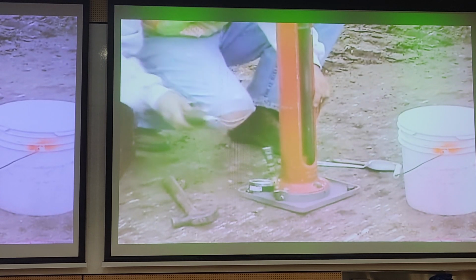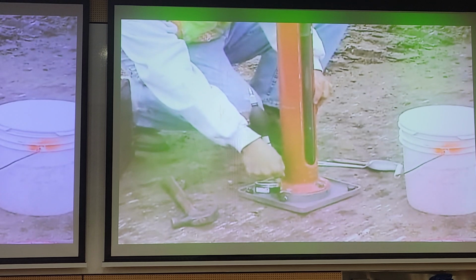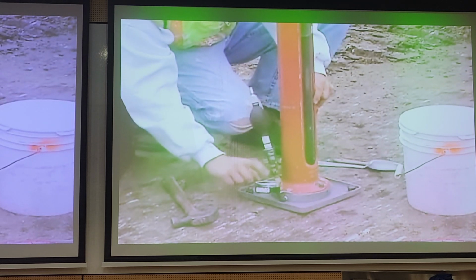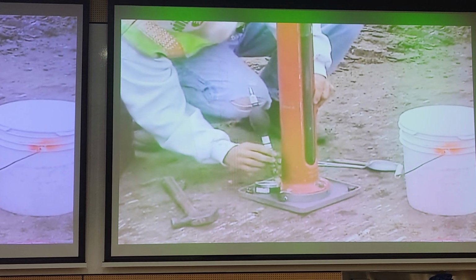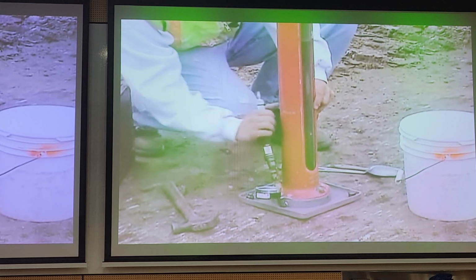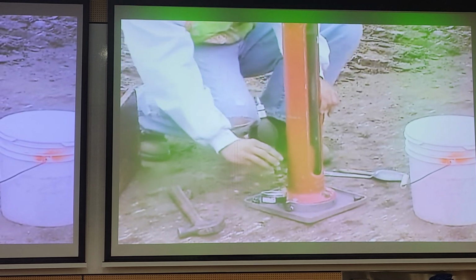Once the device is in place, using the bulb type pump and while holding down the volume measure, force the water down into the balloon until resistance is felt. Apply the calibrated pressure and note the reading on the glass cylinder. After the reading is noted, reverse the bulb type pump in the quick coupler and pump the water back up into the graduated glass cylinder.